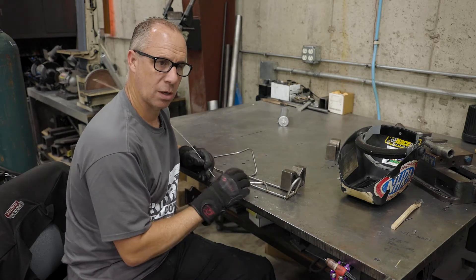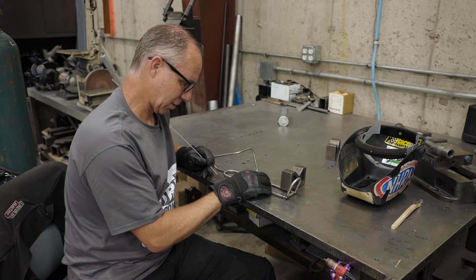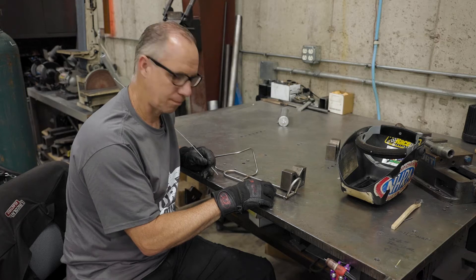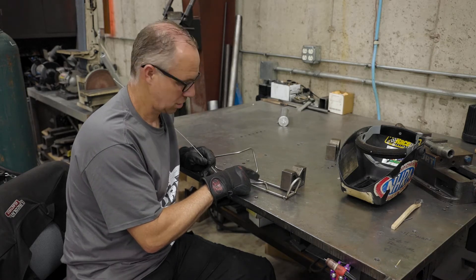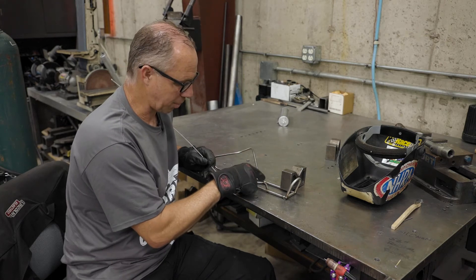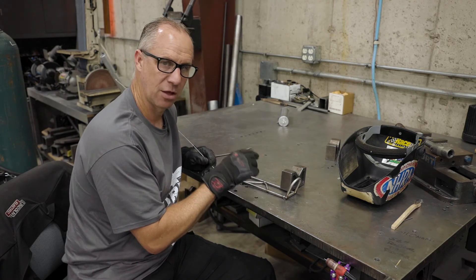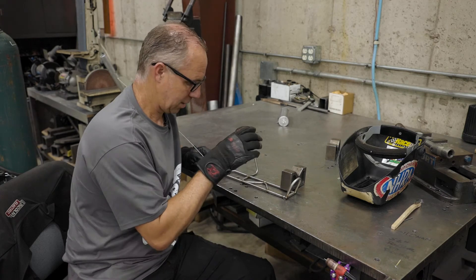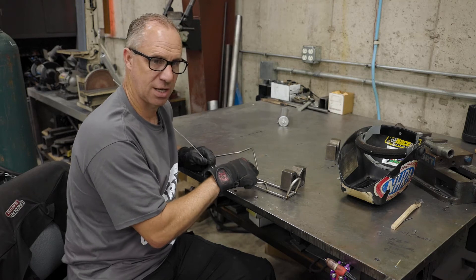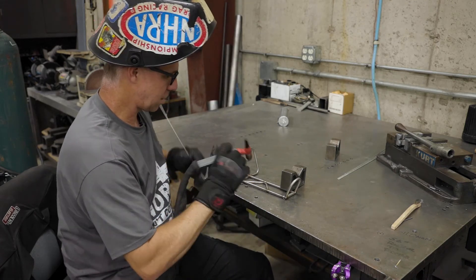There's really no special cleaning tips needed. When welding this titanium for race cars, it's a little more difficult. Say this pedal here is 49 wall and the part I'm welding is 22 wall — you're going to want to put a little more heat into your 49 wall than your 22 wall because you'll burn right through it. Once you get your puddle going, just keep in that puddle and keep it going. The most important part on titanium is when you're done welding, do not yank your torch away. Keep that argon around it for at least 10 seconds so that oxygen doesn't get in and oxidize your part and make it brittle.